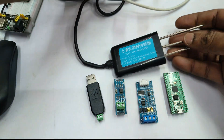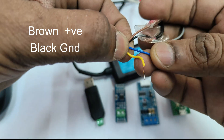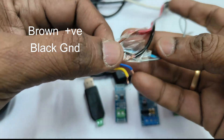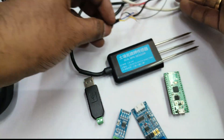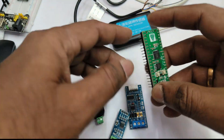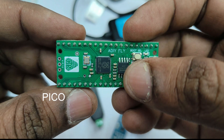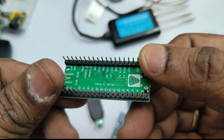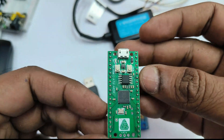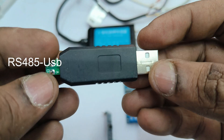The sensor has stainless steel arms. The wire connections use RS-485 — the blue wire and yellow wire are for RS-485 communication, and the brown and black wires are for power supply. We will be using the Raspberry Pi Pico — this model is without Wi-Fi. In upcoming videos we will use the Wi-Fi model.